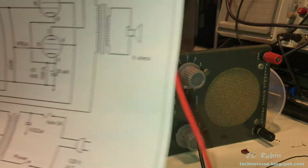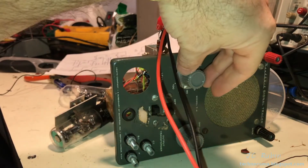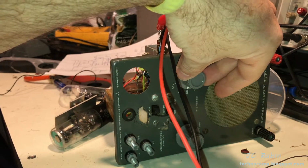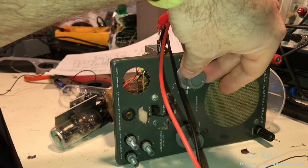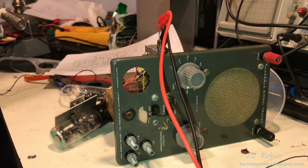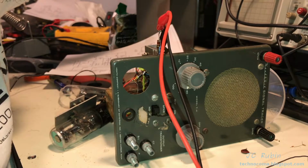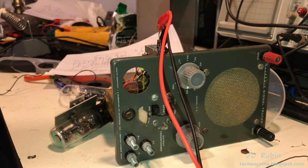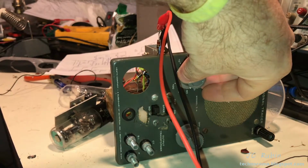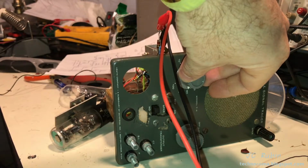The other thing I want to point out is obviously that the tone control is locked down to a specific position. So I'm going to see if I could just, I'm really driving this. I got 1/10 of a volt. I'm going to see if I could drop this just a little bit here. I got the 0.02. I'm starting to pick up noise though, unfortunately.